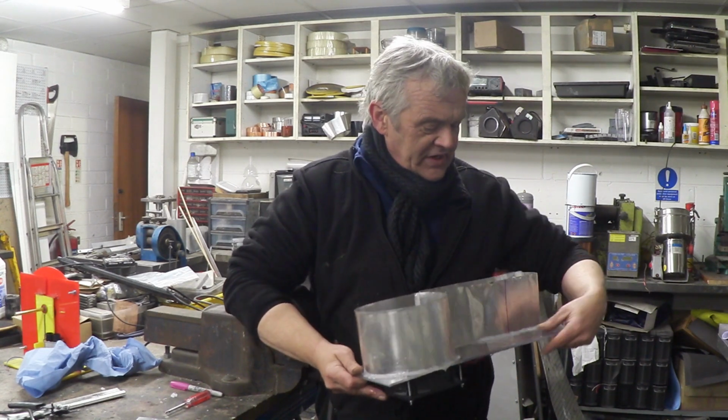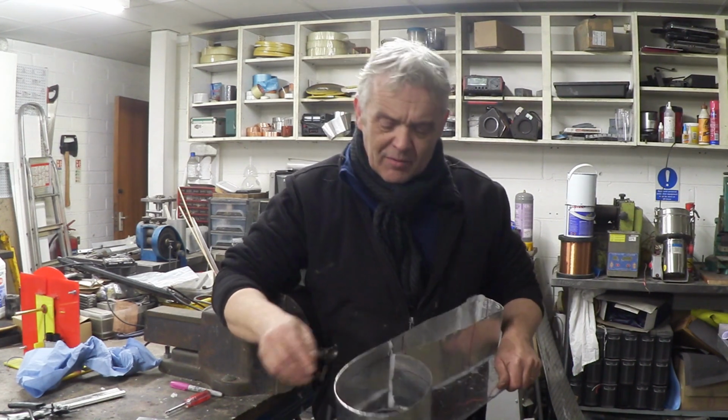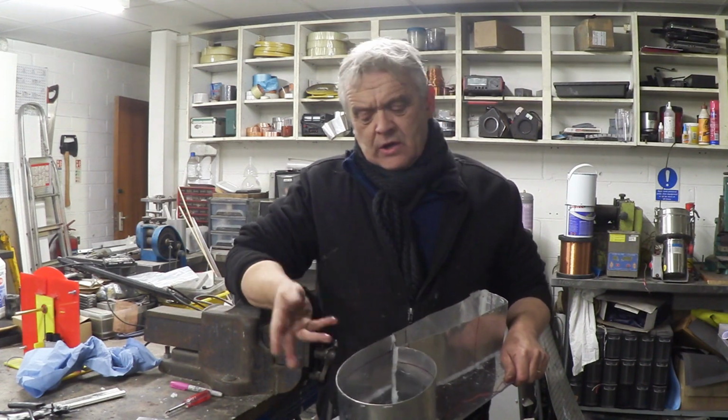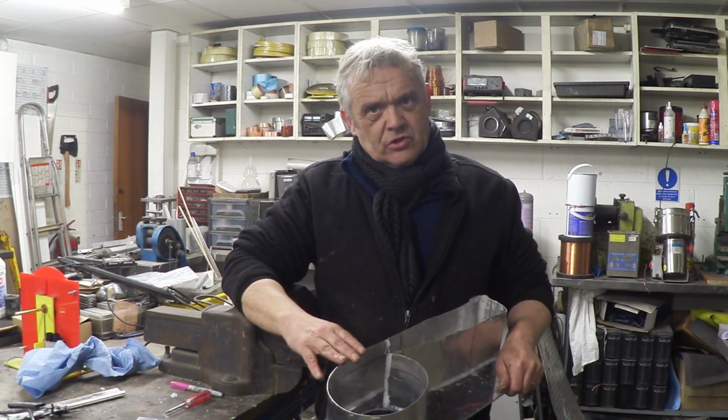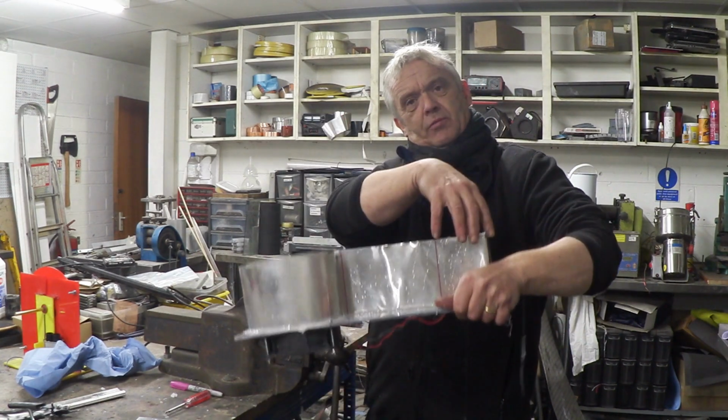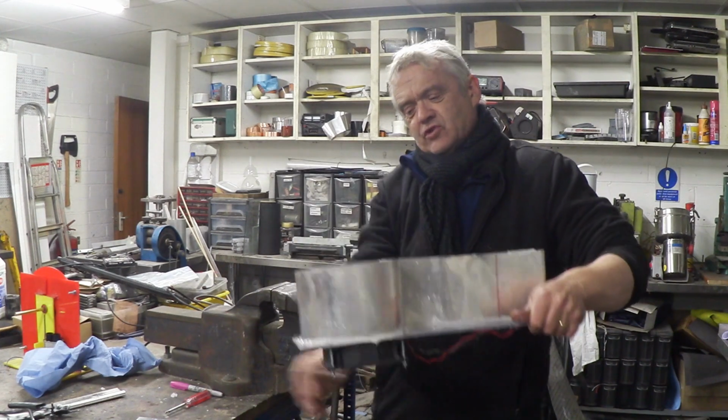To get some real readings out of it, obviously we need to make a better thing because, like I say, is that the right size? Well, I don't really know. So we've got some optimization to do on the shape of the involute, but the idea would be, here's your drain pipe. Your water comes out of here, spins around the vortex and drops through.